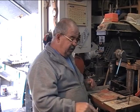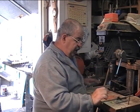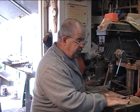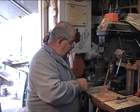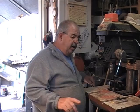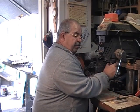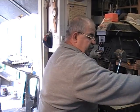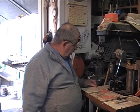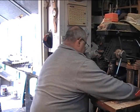Now we're going to look at this and see if this leg is barely touching the table. We're going to adjust the table height until it does. Once we have this side barely touching — no pressure, just barely touching — we're going to swing around to the other side and make sure this side just barely touches. You can raise it up just a bit. I'm going to adjust the height by rolling the bed down a little bit.